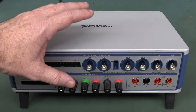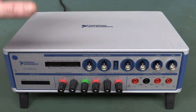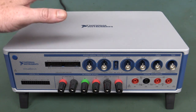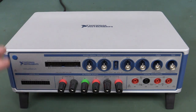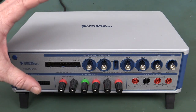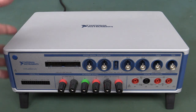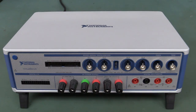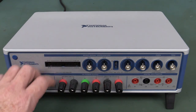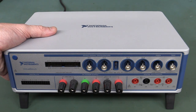They haven't done that — it's just a regular 8-bit digital scope. The hardware inside, as we saw in the teardown, is absolutely top-notch. In fact, it's more capable than the specs this thing's got. It's basically a complete lab in one box: mixed signal scope, function generator, multimeter, power supply, digital IO — all tied into National Instruments software.